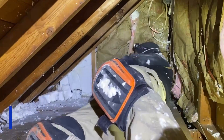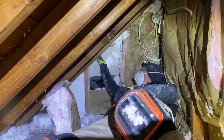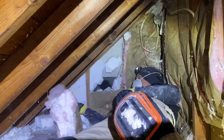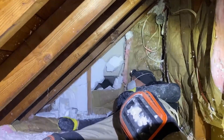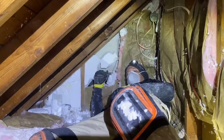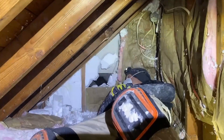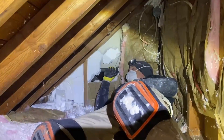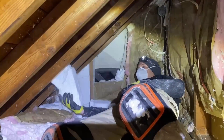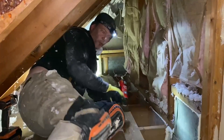Just what you want after spending thousands of dollars with another company. We will dense pack this with cellulose insulation. Once that stuff goes in, it's not going anywhere — it's a purely physical process, it infrareds great 20 years after the work is done, and we guarantee you're never going to have anything like this happen again. And this was done just last year.